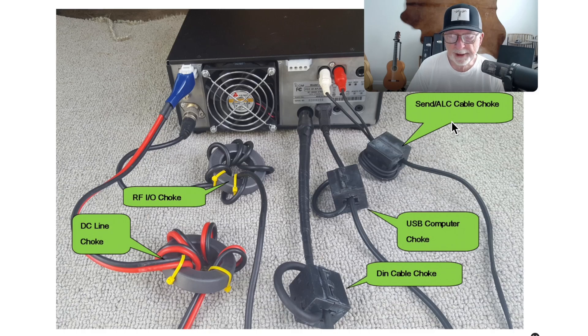Remember, the Earth is a poor conductor at RF frequencies. Inside the shack, put RF chokes like you see here on every cable, including computer cables like USB cables. You need these to stop unwanted RF current. Also, bond all equipment together with short, wide copper straps or braid. This keeps everything at the same RF potential, stopping currents from flowing between your gear. If you want good RF performance and a quiet shack with no crazy problems caused by RF floating around, forget the idea of the magic RF drain rod. At RF, everything is an antenna.